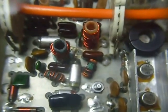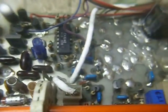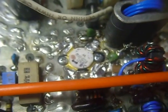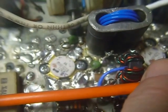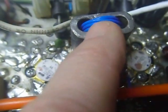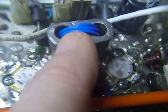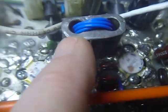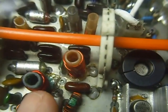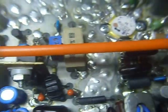There was a lot of parts missing. I just got it to operate for the first time yesterday, and it seems to be working quite well. I changed the output transistors here to MRF421s — those are old ones that I had, but they were still good. I rewound that output transformer using Teflon wire. These two coils were missing; they were not on the board, and so I made substitutes for those two.